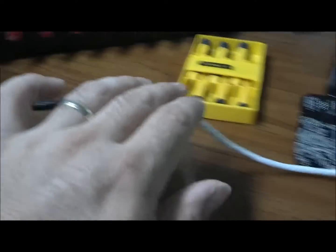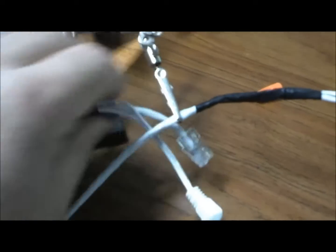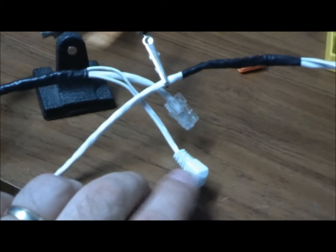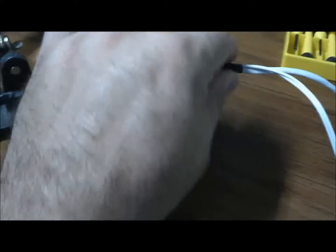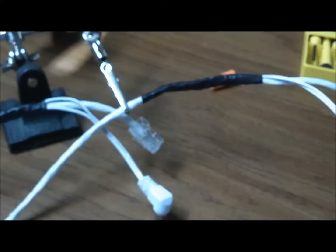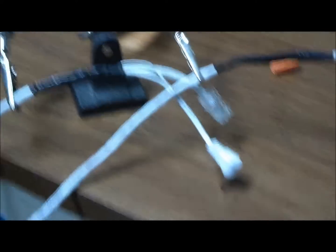The camera worked. This is the power supply for the cam coming down and feeding into the Cat5 cable. Here's the part that is going to go into the router. So this comes from the router, I feed power into the two unused pairs, and then it comes back out here where the cam hooks in — and here's the power. We extract the power from the Cat5 cable here. Everything is heat-shrinked well and I even went over it with some electrical tape, just to make sure we have a good water-tight connection.